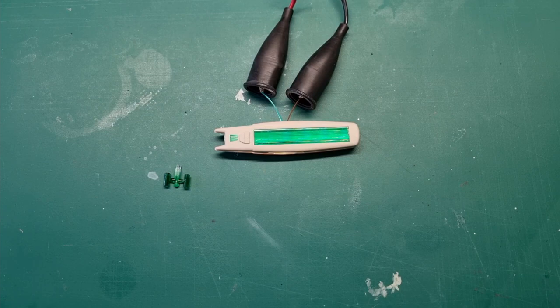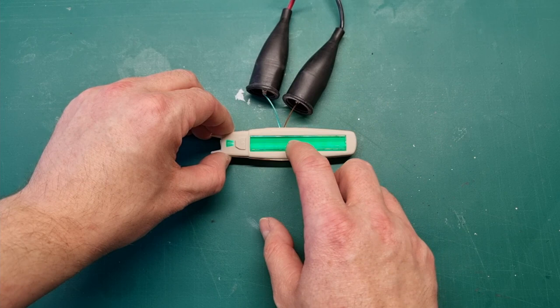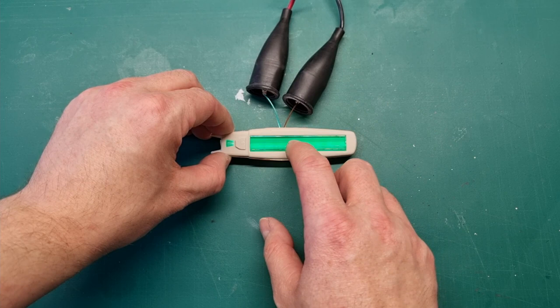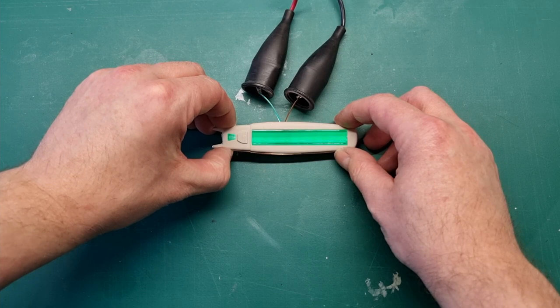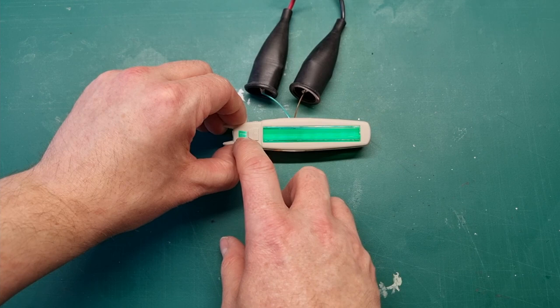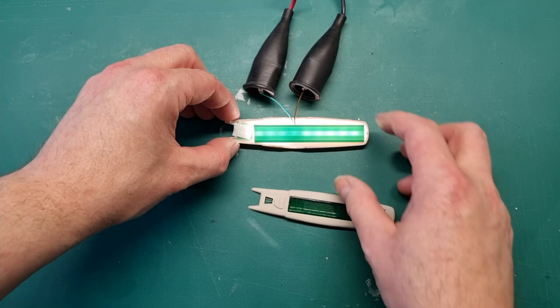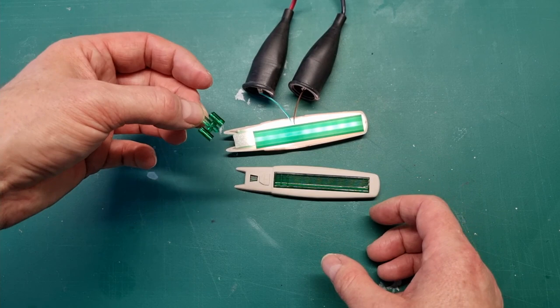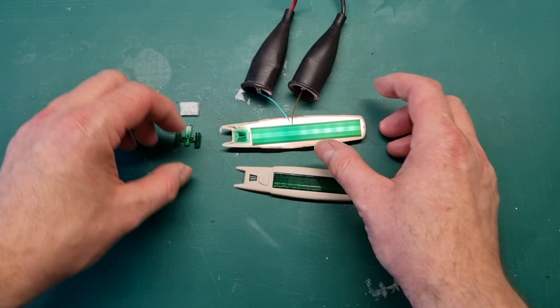The diffusion result is pretty good — a bit hot-spotty, but that's because the sheet is sitting on the LEDs. I'll stick it to the back of the clear part so there's a slight gap, which will diffuse even more. It gives a nice energy-like diffusion layer behind there when it lights up. The front emitters aren't lighting up very well, so I might sneak in a small SMD LED pointing out the front somewhere.